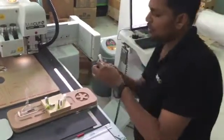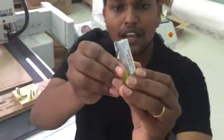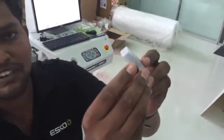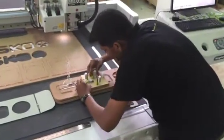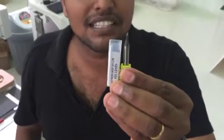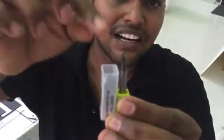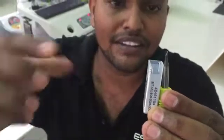The other mostly used bit is the multi-purpose bit. The main difference between multi-purpose and acrylic is that the top surface has a small notch which does the milling. There are also special bits for milling ACP/ACM materials — the carbon-coated multi-purpose bit. You can see a blackish color; that's a carbon coating, and they end with C1, so they are coated bits.